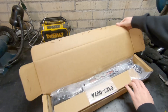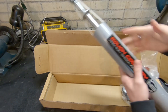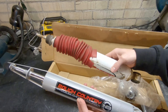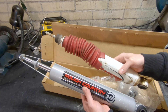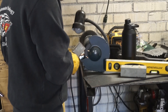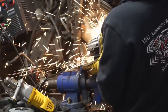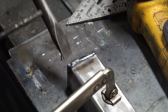I purchased these lift shocks for an F-250. Not only do they have a lot more damping, which will help with the heavy Cummins engine, they also have about a 10-inch stroke, which will give me way more travel and off-road goodness. However, since they're so large, I'm going to have to extend my top shock mount by about 6 inches. The simplest way I could think to do this was to cut out 6-inch sections of square tubing and then weld that on. This is just a shock — there's no spring — so it doesn't need to be as strong as a coilover mount. And besides, this is just pure tension and compression, no bending. Square tubing is actually pretty good with these loading cases. Let's give this a try and see how it turns out.